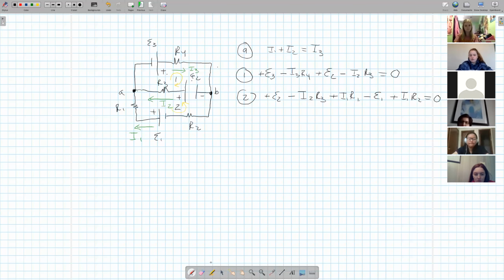Okay. So whatever is connected, remember what's the same in series is current. So if I start off at B here and I go in this direction, all of this has exactly the same current. Or in this case, we're going from here into this direction. But it doesn't matter, as long as these things are in series, they all have to have exactly the same current. Now we arbitrarily call this I1. I could have called it I Callie if I wanted to, it didn't really matter. But I just have to know that since these are all in series, they all have exactly the same current.